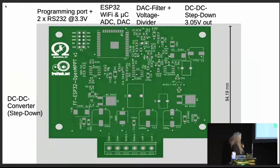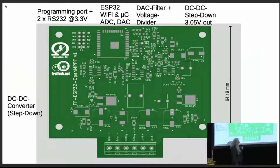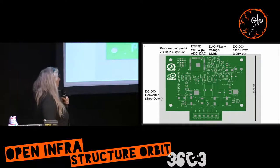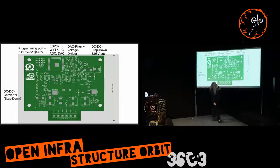Here are the positions of the components on the board. On the bottom we have the power horse — a 95%-efficiency DC-DC step-down converter. There's an extra P-channel MOSFET to control the power output, which can switch many amps if needed. We have the ESP, the programming interface, and a DC-DC step-down converter that you can modify to undervolt the device. I experimented with 2.8 volts — it works perfectly. Since the ESP has linear regulators to produce its core current, undervolting it reduces power consumption even further.